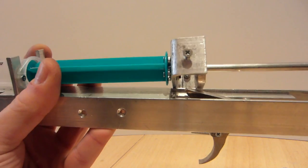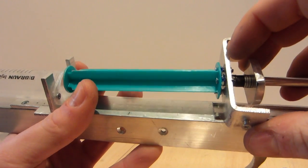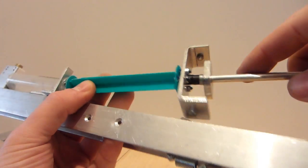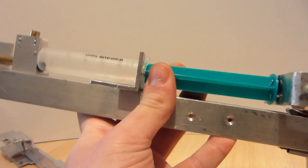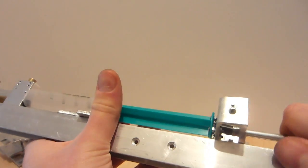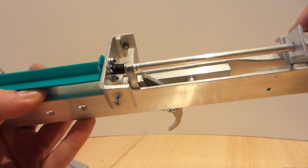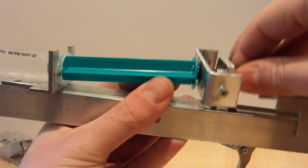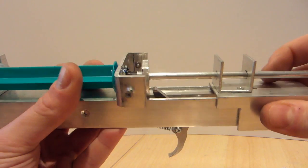is the moving parts of the syringe, which is actually just this guy right here. 4 screws hold it to make sure the force splits up equally and nothing rips off. This part from the catch plate for the lock mechanism, and yeah, you just have to make sure that the optimal distance, you know, when the syringe is at its max, it catches, and then you have your springs here or here, would work also, depending on what spring you have. This U section is just a guide to make sure that if it's locked, it can't escape, because the tension springs will pull. So to make sure it can go up, I decided to use this guide, and yeah, that's actually it.